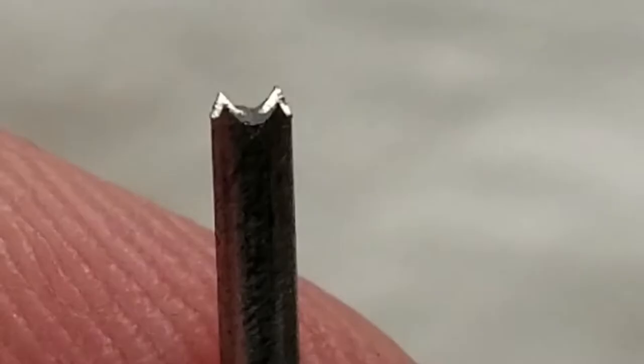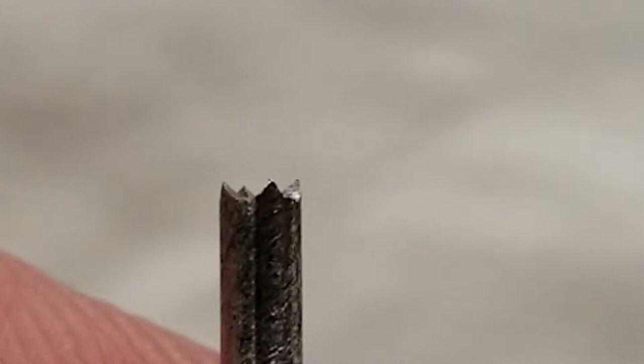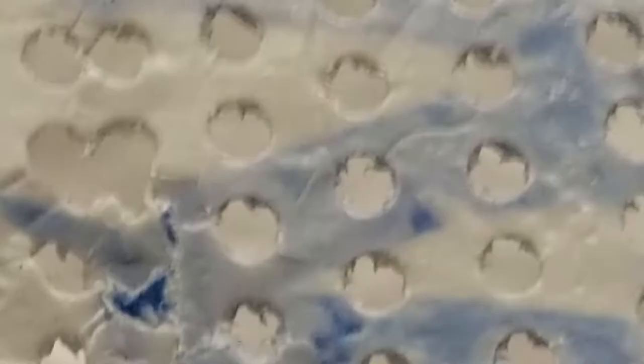This nail is interesting — it's a really sharp nail, but one tip is sticking out higher than the others. That means that one tip punches initially and the other three kind of rip it, giving you four little tabs instead of a nice clean circle. The more off those tips get, the bigger that star-shaped pattern will be in the hole, and the more likely you'll need to pull it out and repolish it.